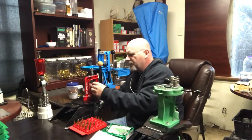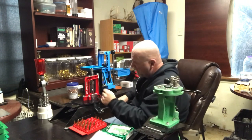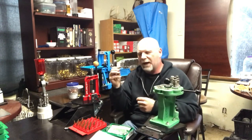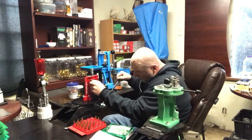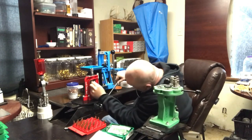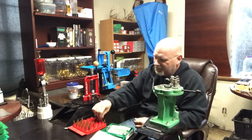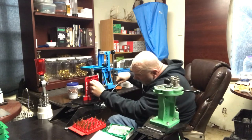Then you take your brass, put it on, and push it into the die. Once it's in the die, just push down and pop it. To get the brass off, just pop the press — and what that does is take out the crimp in the primer pocket. You only have to do this one time to the brass. The hardest part about using this tool is getting it to go in over the little collet, but once you get it, just pop it in, take out the crimp, bring that down, pop the press, and out comes the brass.